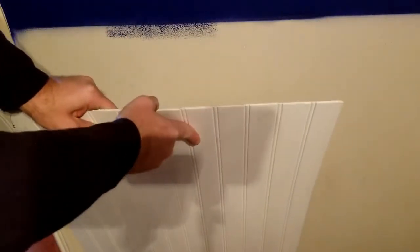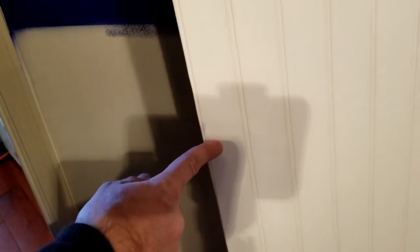We're doing the wainscoting now, and of course, nothing's ever perfectly level, so I've lined this up against the bottom and then took measurements and had a little more than a half an inch that I had to trim off the edge. You can see wide and gets narrower, so that it would fit properly into the spot. You can see now that it fits pretty well. That's enough that caulk will hide anything. So we'll just continue around.